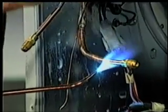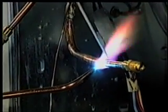Connect a sweat-in valve to the hot tube discharge. You'll connect here so that you can flush the system in the reverse direction of its normal flow. Be sure to remove the Schrader valve stems if you're sweating these connectors on. The heat from the process will ruin the valve seats.